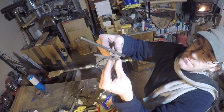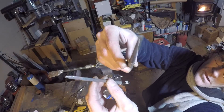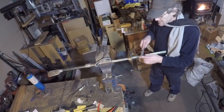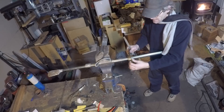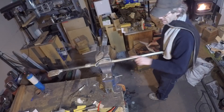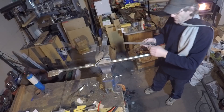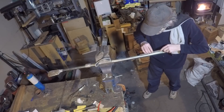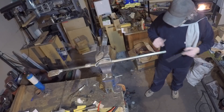It's a good idea to have tools like these — one I made, one I bought. One more thing: if you do file your axle to remove that machined fold-over in the groove, don't use too much pressure or you'll fold it over further. Use the edge of the file, put it inside the groove, and lightly take off all that material from the inside.